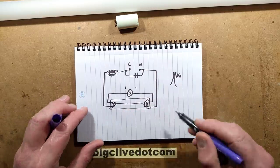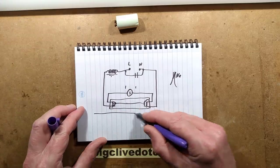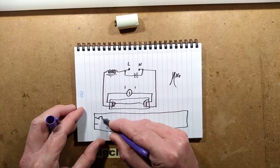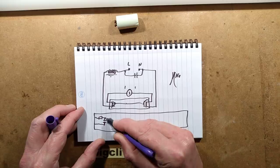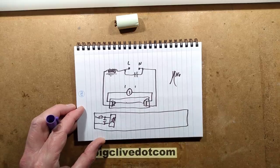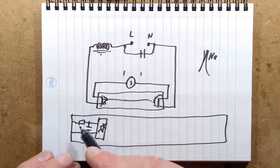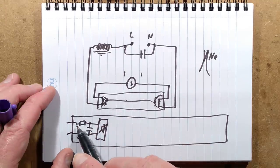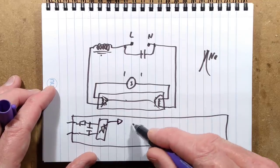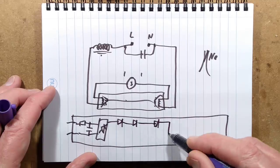What we're doing here is putting this LED tube in place of a fluorescent tube. I'm going to try and emulate what I think is inside. I reckon there might be a resistor and a capacitor just for filtering, then a bridge rectifier, and then possibly loads of LEDs to make up the combined voltage above what a traditional tube would have had.